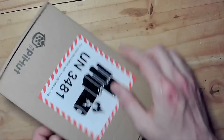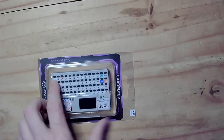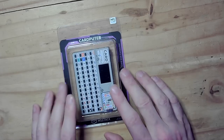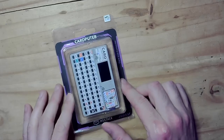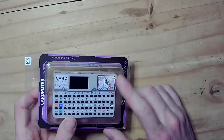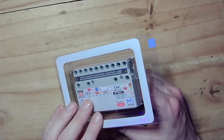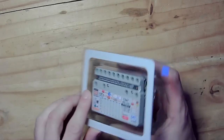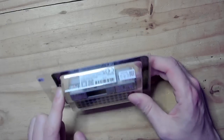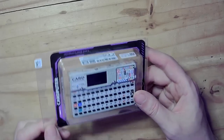So here we are, straight from the Pi Hut with its lithium battery safety notice. Inside is this — the CardPuter, or 'card pewter' as it's kind of branded — from M5 Stack. It's literally a mini programmable computing platform powered by the Stamp S3, which is a version of the ESP32 microcontroller. It has dual lithium batteries on board, is Lego compatible — these notches on the back are for that — and it has a full QWERTY keyboard, SD card, microphone, a buzzer or speaker, and a very small TFT color display.